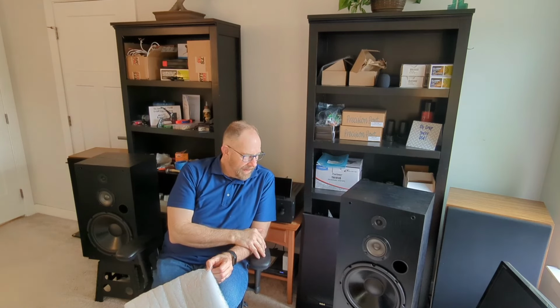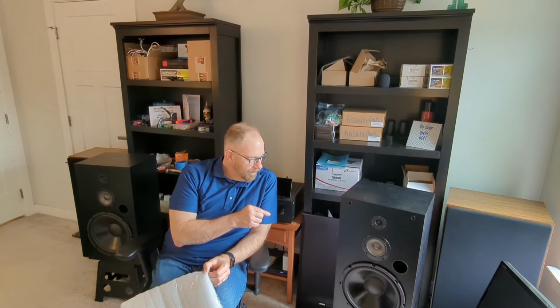Right now, when I run frequency sweeps on them, they start to hit my baseline, my reference line, at roughly the 40 to 50 hertz range. Theoretically, I think that this box is tuned to about 25 hertz, and that just happens to be the lower range of that woofer. It's not causing a problem per se, but the bass response is a little bit wonky, not quite as full-bodied or punchy as I like it to be.